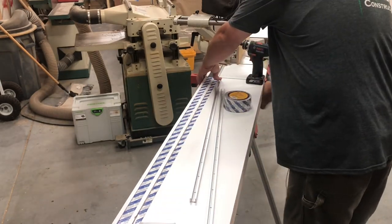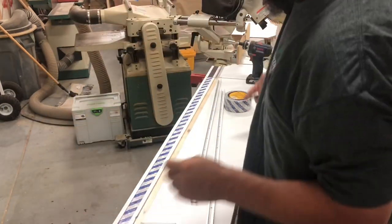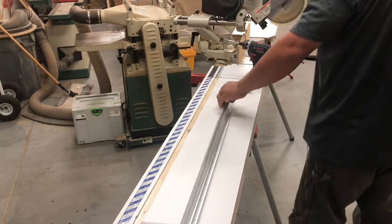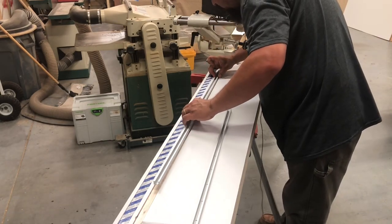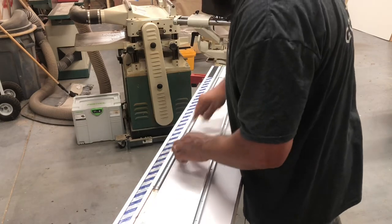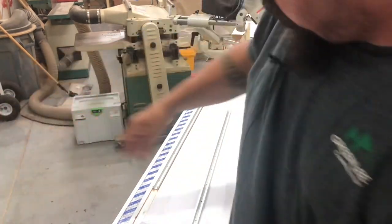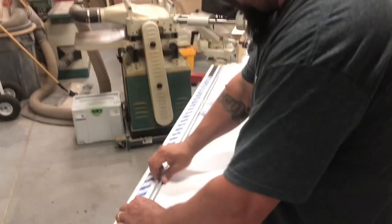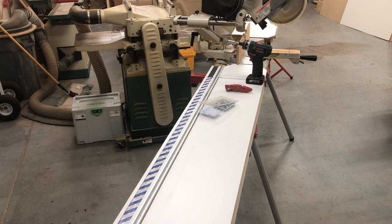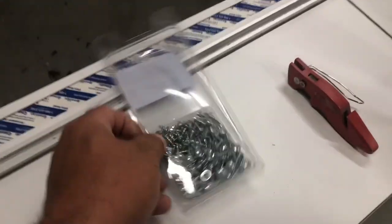Make sure your wing is all the way back. Pull up the speed tape. Because of the groove — I know my groove is off in width but it's still straight — I can just slam it to the back of this dado. With that FastCap speed tape in there, it holds it for me and that allows me to drill it down. Stick it down and it won't move on me. Now I can go back and screw it off. You can see it holds already with just that double-sided tape, which is pretty good. Then you can just come by and screw these.